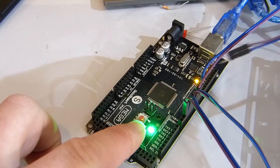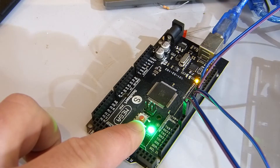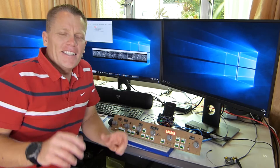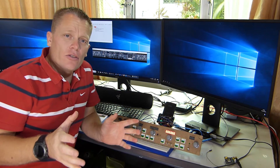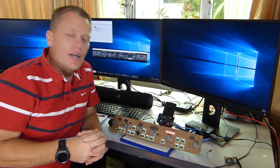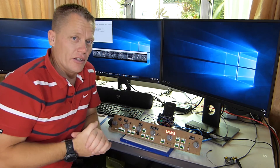Onto the new board — the next pins are 2 and 3 and they come from the speed encoder. Pins 4 and 5 are for the heading encoder. Pins 6 and 7 are for the first officer's course encoder. And pins 8 and 9 are for the vertical speed encoder. So wiring the KY040 encoders is really simple: two wires for ground and positive 5 volts, and then two wires for data and clock. That's the way to look at it, nice and simply.